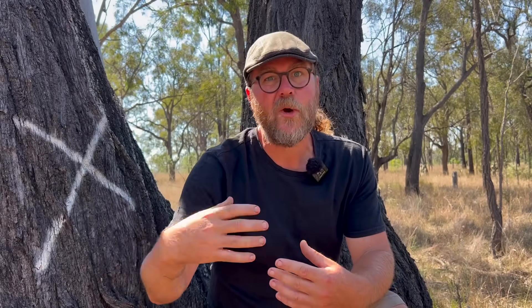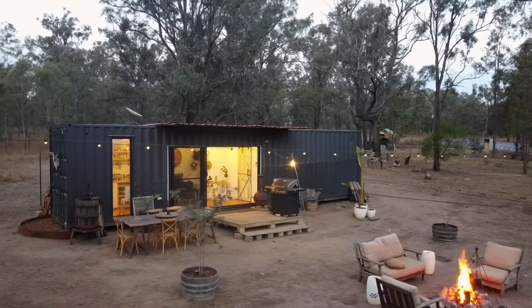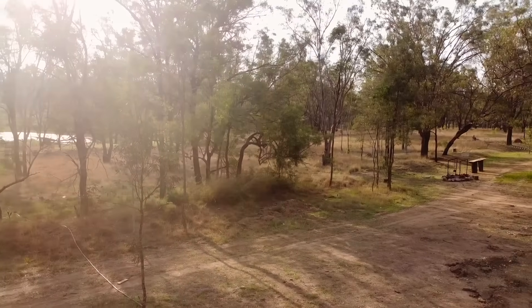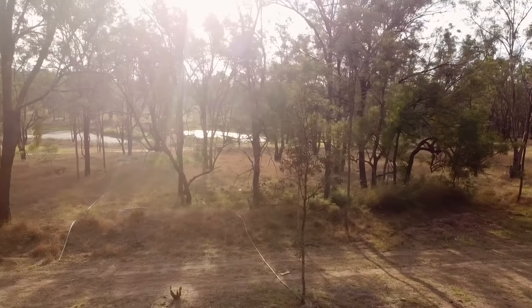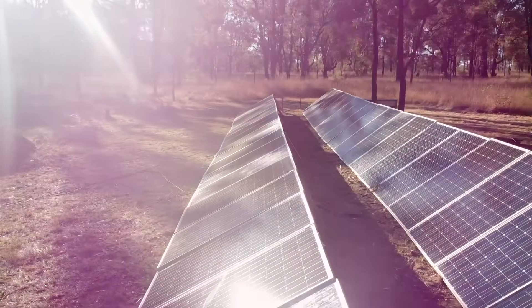The mistake I made was not figuring out exactly where true north was. We did find north, but then I made an assumption. When we started to set up our solar panel arrays, I looked at our tiny home and assumed we'd put it north-south with an easterly outlook. But actually, we chose the outlook based on looking straight down onto the dam because we wanted the view. And so we were a little bit askew of a north-south orientation, and I forgot about that when we set up our solar panel arrays — so they were in alignment with the tiny home, which was probably nearly 45 degrees off north.